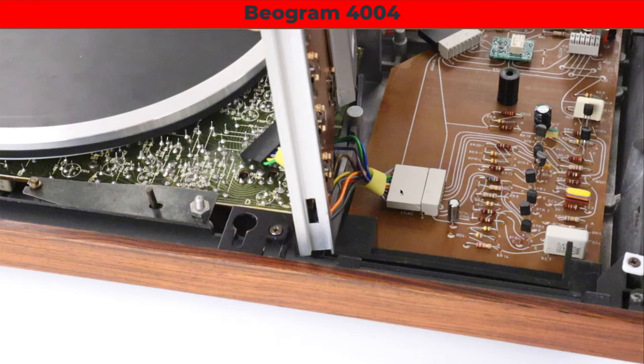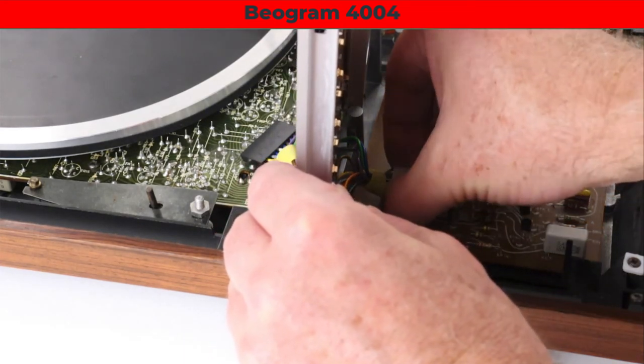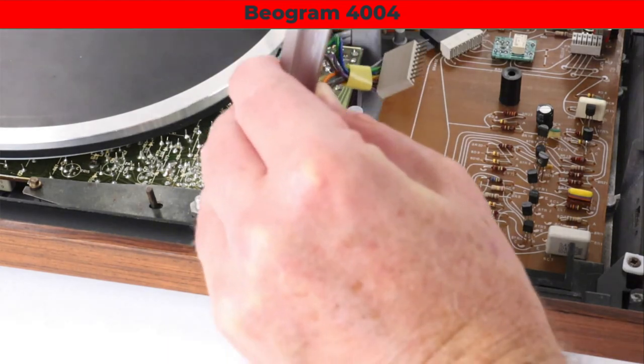To take out the keypad you will have to remove this white plug. Before you do that, I strongly recommend taking a picture with your cell phone or camera to ensure that when you put things back together after installing the commander board, this plug is in the adapter board in the same orientation you found it originally. There are also markings on the board — it says 'lilac' for purple and 'gray' on the other side, corresponding to the wire colors. Okay, let's take it out.